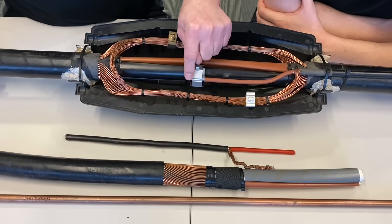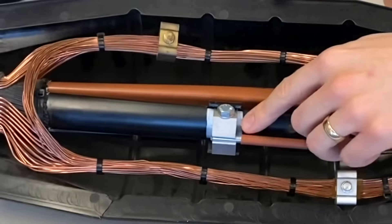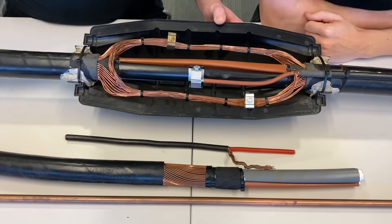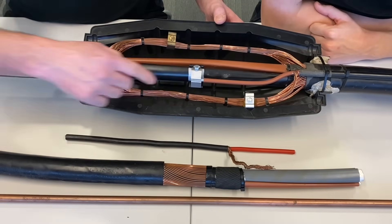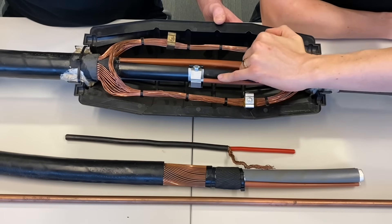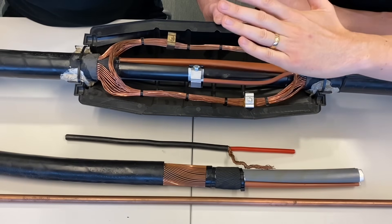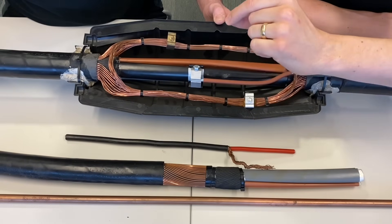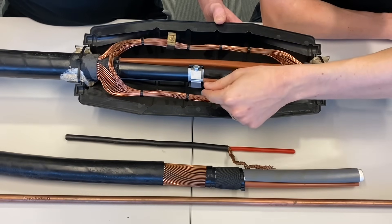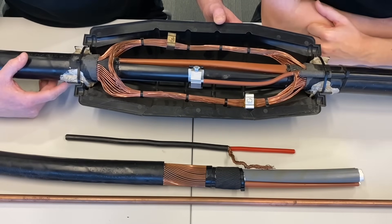There is a clamp onto that aluminium cable — the conductors haven't been cut, even the one we're connecting onto. Therefore the line conductors have maintained their integrity throughout. By not breaking the line conductor, we obviously won't lose it. What sort of material have we clamped onto the aluminium conductor? You can see it's aluminium throughout — aluminium conductor, aluminium clamp, and aluminium conductor going out to the new property. It's important to keep metals the same because of galvanic corrosion, which occurs when metals that occupy vastly different spaces on the galvanic scale damage each other and could deteriorate completely.